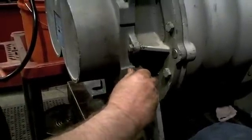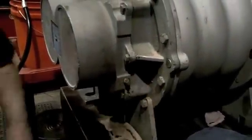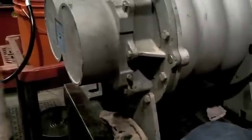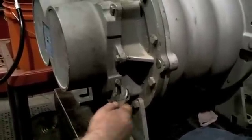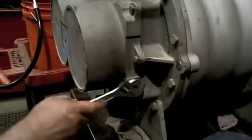Reinstall the pipe plug. Be careful not to over-tighten, as this may damage the aluminum gearbox housing. The unit is now lubricated. Be sure to check your lubrication levels frequently to ensure long equipment life.